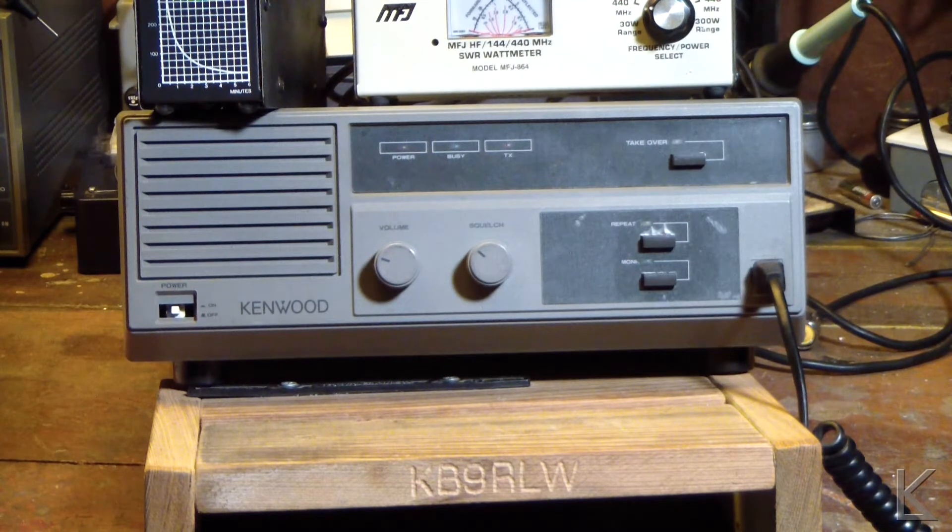It can be brute-forced into the amateur band — I've done some research and it's quite complex. Inside, behind the front panel, there's an EEPROM, an electronically programmable read-only memory. You'd need an EEPROM burner and would have to change eight bytes in the EEPROM to set the frequency. Then you could tune the receiver preselector for sensitivity in the new frequency range, do various tweaks in the transmit section, and you'd need a service monitor to precisely tune the duplexer.